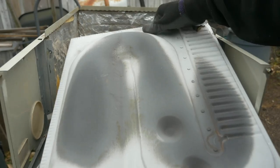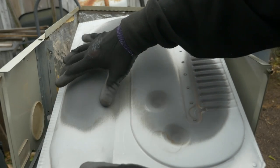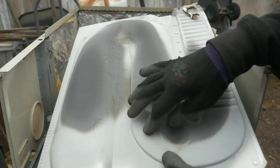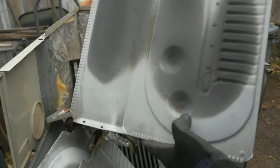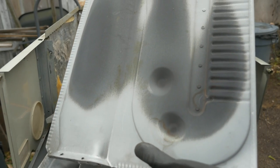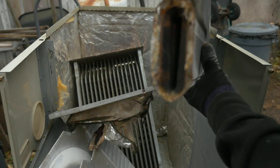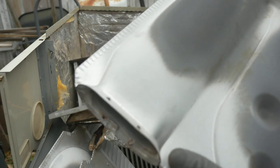This is kind of an interesting burner heat exchanger profile, because when the air comes in here, this is wider, and as it gets over here, it gets thinner. And down in here, it starts to restrict the airflow. Oh, look, I don't know if you can see it, there's a crack right there. That's one place where it's gone bad. A couple more in here. As it comes out, it's much narrower, and I believe operating going much faster. That would be my guess.